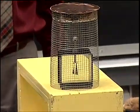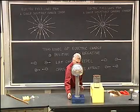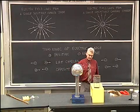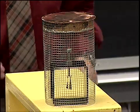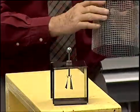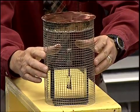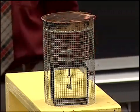We see the effect of electric shielding: with the metal conducting cage surrounding the electroscope, the electric field inside the cage is zero. Now, I'd like to remove this shield and notice what happens. The leaves will again separate, and when I put the shield on, that screens out the electric field, showing the effect of shielding. Thank you.